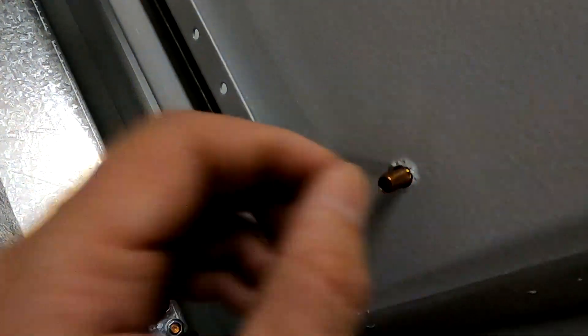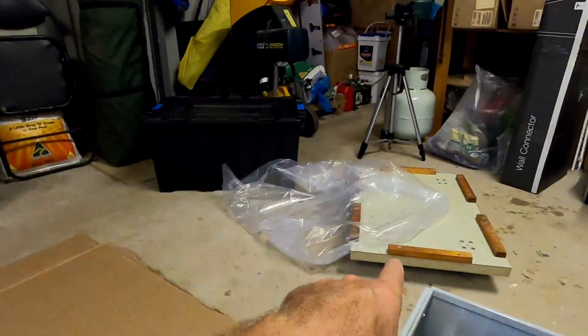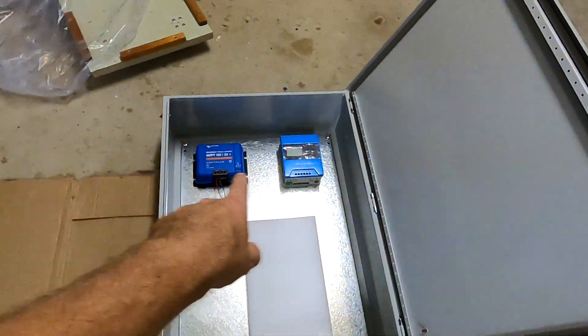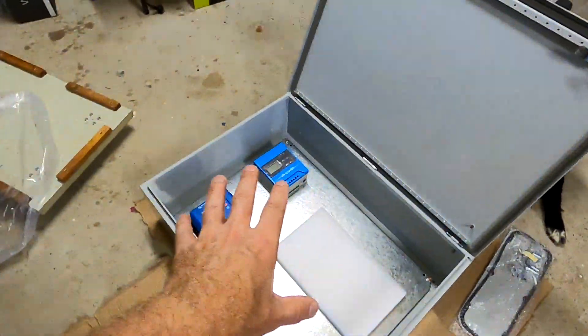So this is all dust and waterproof. You can also put the door on the other side if you want to. This is for ground earth contact, and another one here. Very solid enclosure. One of you guys left a comment saying I should just use a piece of plywood and mount everything on this. I could have used our bench top offcut here to mount everything. But I'm not a big fan of mounting these things on timber or wood, because of fire safety hazard - this should always be on metal and grounded. Just in case one of the charge controllers starts a fire inside, there's no harm to anything here. This is a very safe enclosure for my project.